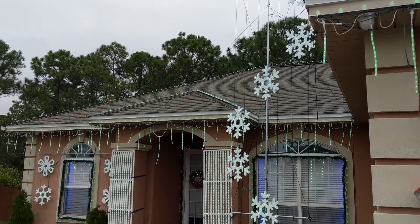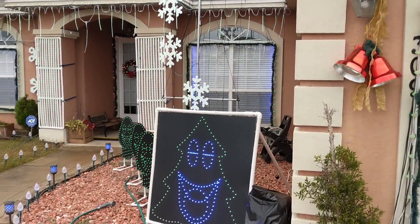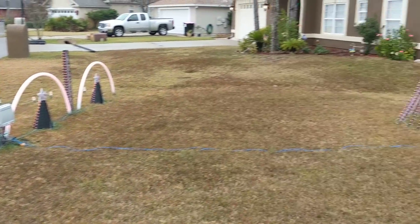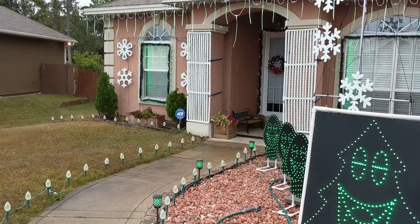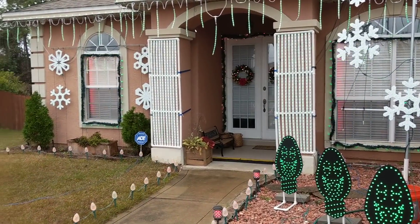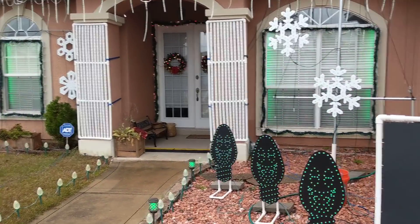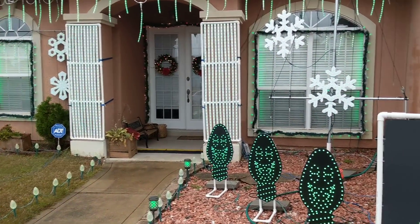You can see I have C9s on my roof going all the way up to my snowflake tower. So that's behind my show — that's how it's wired and set up. I might change it a bit next year: I might put both Falcons behind the columns — one behind each column — and then run differential receivers out to the boxes in the yard, so the more expensive parts are closer to the house and the networking to them would be at the front of the house, with everything else just being pixel signals traveling around.